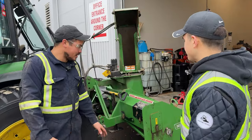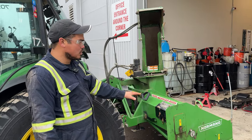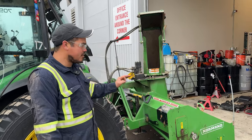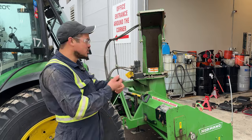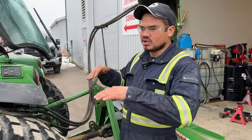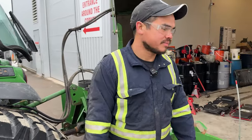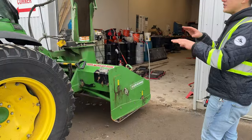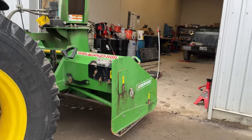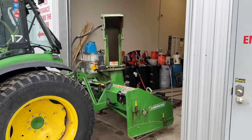This is another important thing. After you put it on, remember that whatever inclination you were giving to your blower, you gotta change it to make it perfect to the new blade, right? You gotta be adjusting the 3-point hitch all the time so you always have it at the right angle to scrape good enough, but not over scrape, right? Lay it flat, let's see how it looks. Yeah. If we gotta adjust the top link, we will. That's a very good point, Eric.